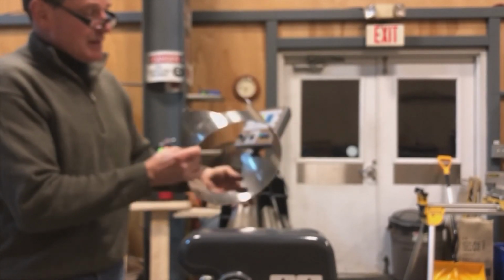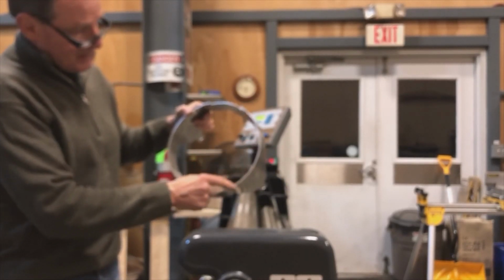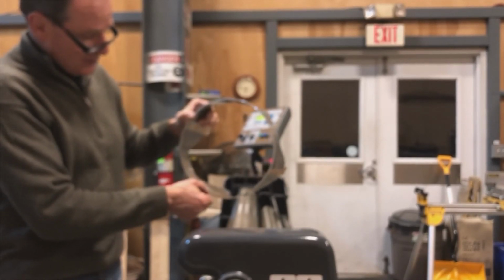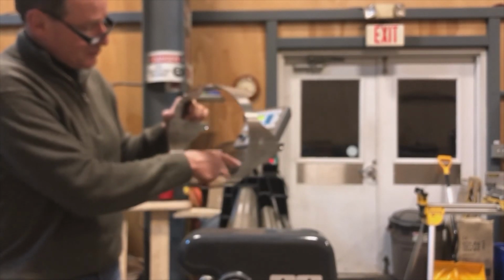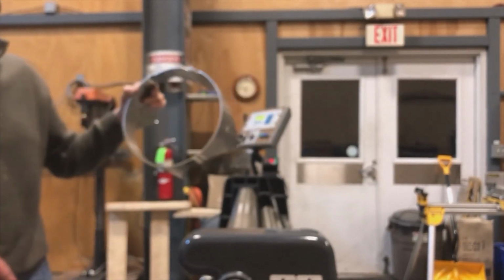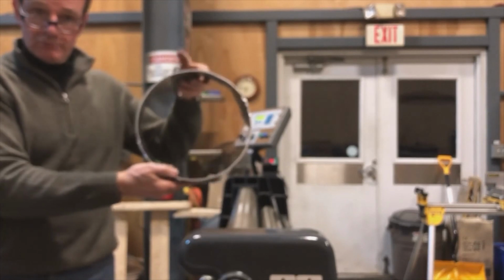Reasonably round. It's not going to be perfectly round. Again, you're going to be overbent here, you're going to be underbent here where you have large cross sections, right? And you almost get nothing here on this tab, and you practically have nothing on that tab. If you want to bend those, you need to pre-bend those on a press brake on a special tool. Okay, and this is your small crown, right? Should be good. This is your program number 4.